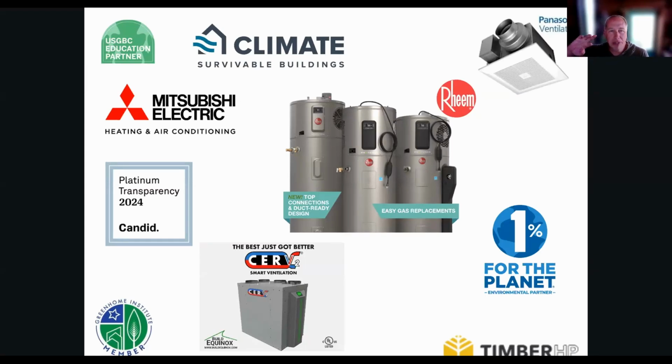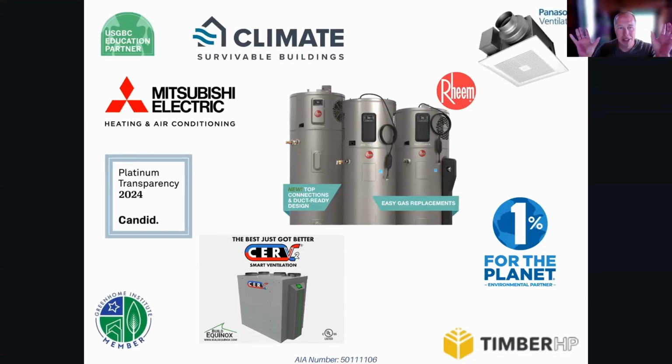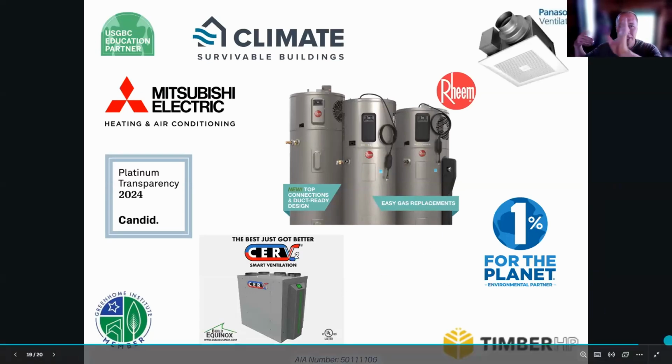Well, let me flip it a little bit, because what we've found is that energy recovery ventilators, which address otherwise unbalanced homes with leakage, are basically recovering air conditioning as it's going out and getting cooler air brought in, or in the wintertime, they're recapturing heat as you're exhausting air out. That reduces the HVAC load, the air conditioner load or the heating load, and it reduces it in a power efficient way. For example, an old commercial building might have 40 tons of air conditioner heat pump up on the roof. You might put in 20 tons as your finished retrofit, plus the equivalent essentially of 20 tons of ERV. And the ERV is going to use far less power than a potential other 20 tons of heat pump that you could have put in there. So commercial buildings frequently don't have to have any kind of service upgrade if they install energy recovery ventilation, which allows them to put in a much smaller set of heat pumps, and it frees up power capacity for other things.